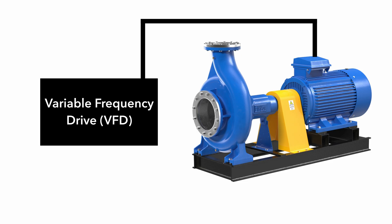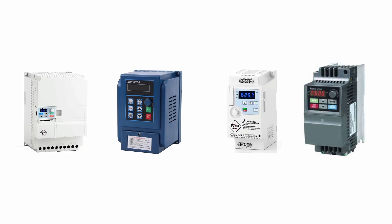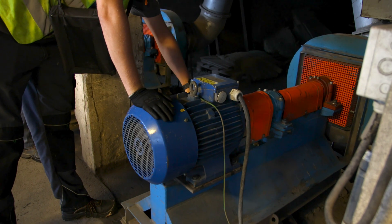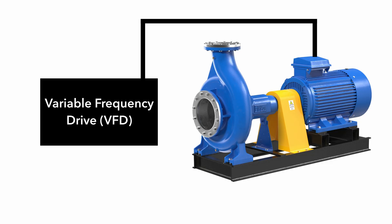What is it for? Many machines are powered by VFD — it means variable frequency drives. These drives generate strong noise on high frequencies. We also measure the bearing condition on high frequencies. The high frequency noise from variable frequency drives makes bearing condition measurement almost impossible.